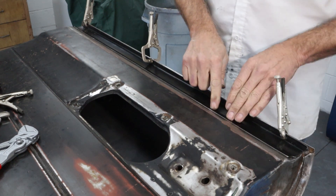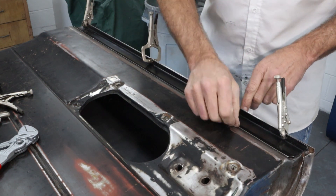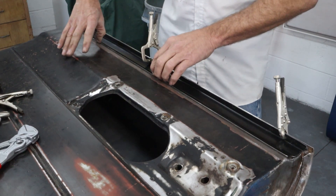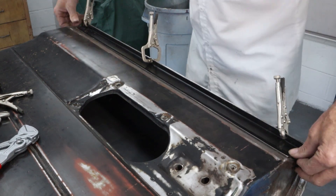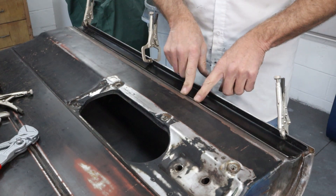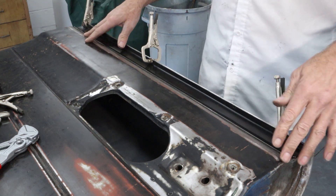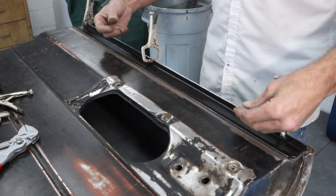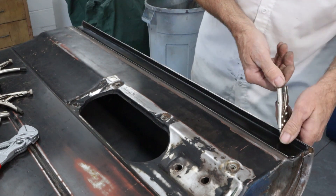I was a little concerned that the patch panel might be a little bit long because the flange tool makes a little radius there and doesn't make a square corner. I was afraid that was going to stick up into that corner, but it's not — it's feeling really good. It's a little close right here, but it is down inside there. If it was too long, all I'd have to do is grind this line back a little bit on the patch panel to make it smaller. It's fitting really well, nice and flat, and fitting really tight — I can't even get my fingernail in between the two pieces of sheet metal on the back side. So the next step will be to do some rust preventative before we move forward, then put some sheet metal screws in here to clamp it all together so when we weld it up, it's nice and tight. Let's take this apart and figure out what we're going to do for rust preventative so this doesn't happen again 70 years from now.